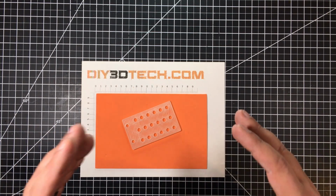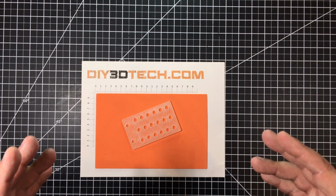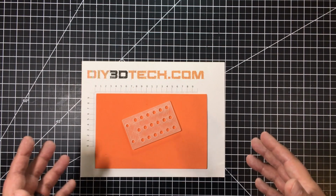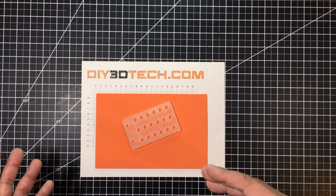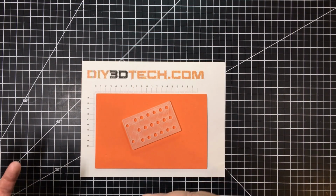Now, again, in that recipe, those were his results. What would his results have been if he had over-extruded it, turned up the temperature, added other variables? So it is definitely a good reference model to be used inside of just normal 3D printing, that if you want a part to be more resilient along the layer lines, print with a smaller layer height.